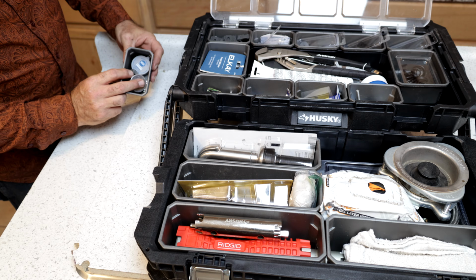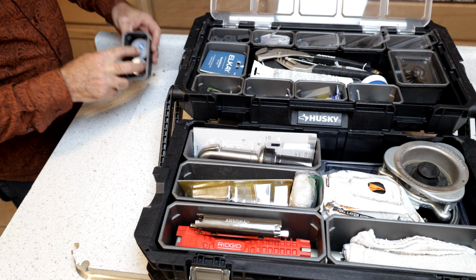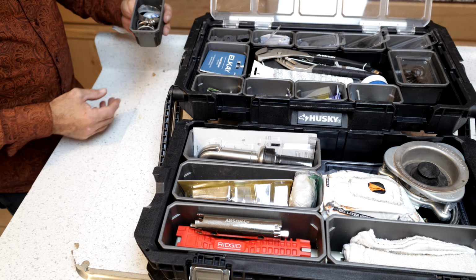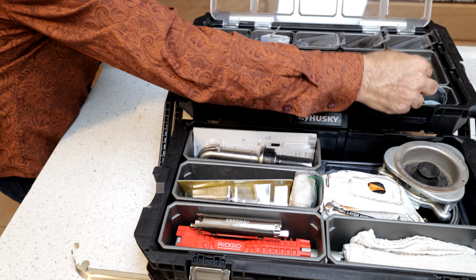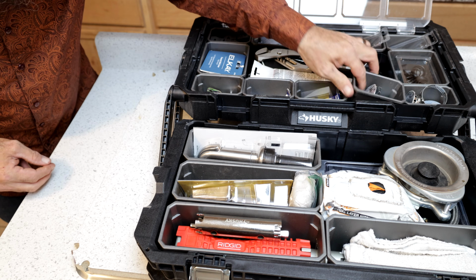And now you may not see this called faucet grease. This is just a food grade lubricant so that you can use lubricants on your O-rings and stuff when you're installing these on potable water systems, and it's not going to harm the potable water within the home. I've got a few more of those caps with just different attachment styles.